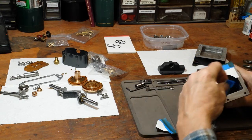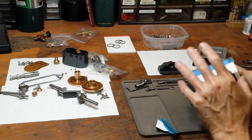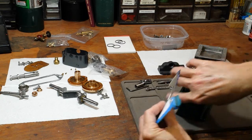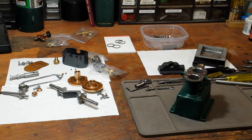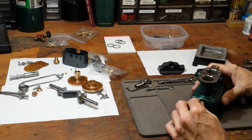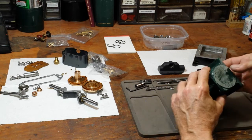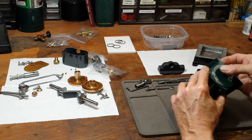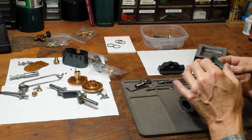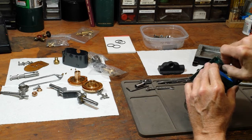The engine runs — even though everything is held to extremely close tolerances, and I spent days on some of them assuring that — it just ticked over so smoothly. I have the cylinders lapped and the pistons very smooth. I'm kind of anxious to see, when I put those rings in there, if it's going to be able to tick over as slowly as it did with the pistons without the rings.